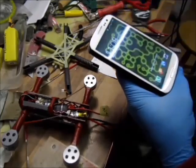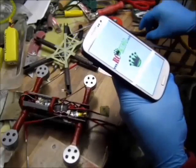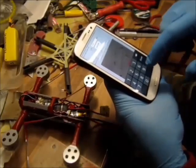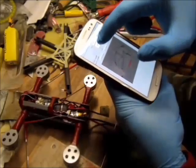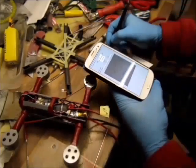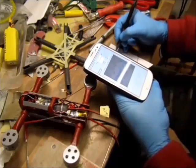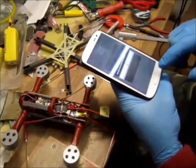Alright, so as I said, I soldered my own CPs. I have here a cloverleaf calculator. I usually fly on Fat Shark first channel, so that is 5740. Done. Calculate. Okay, so I have the whole length of 54.92 and the bend is at 13.73.